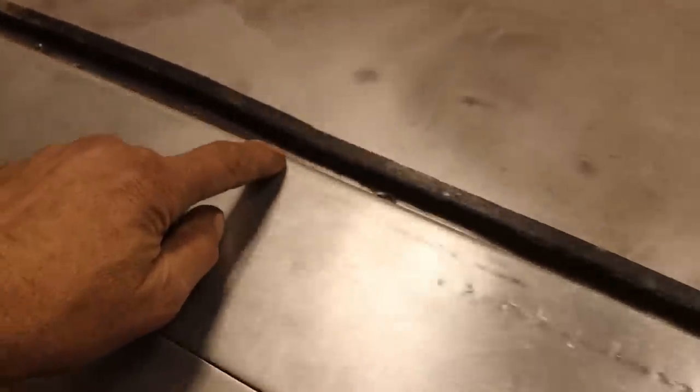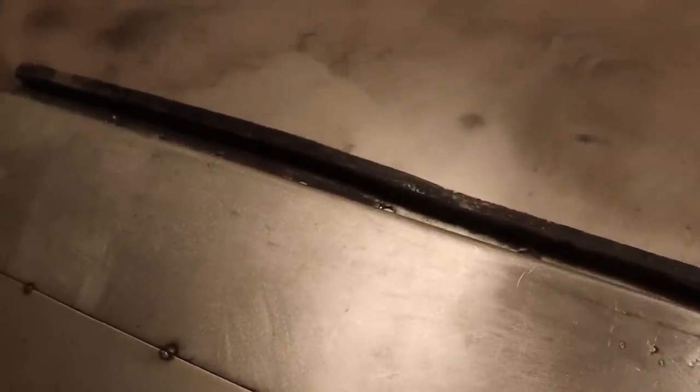And I don't weld on corners ever, because you can never stretch it back out if it's on a corner. If you weld it on a corner and it shrinks and it changes shape, you're kind of done. You gotta start over pretty much. So anyhow,